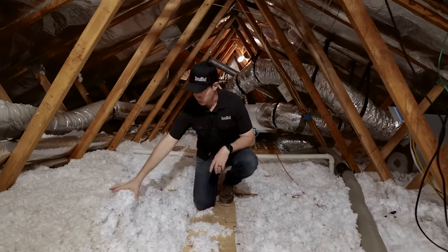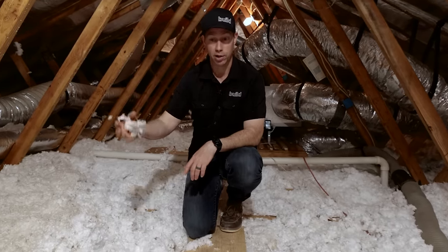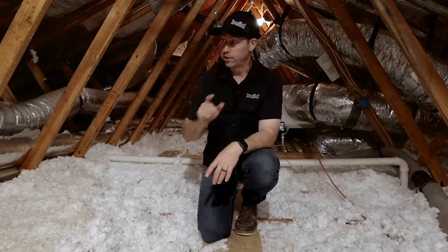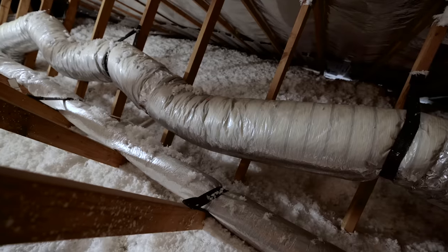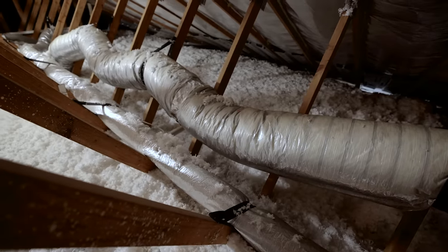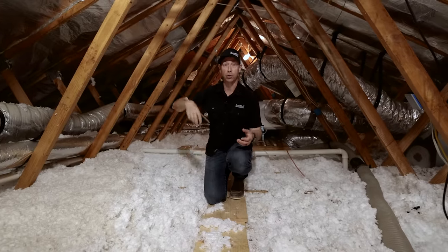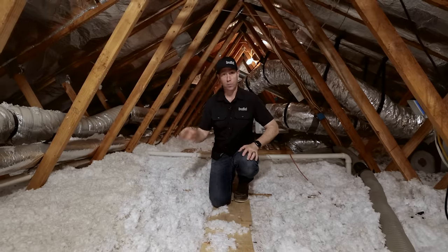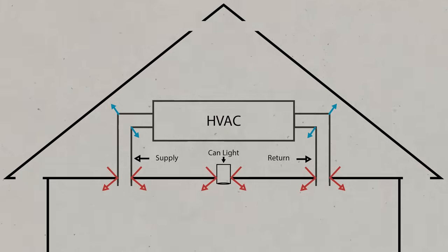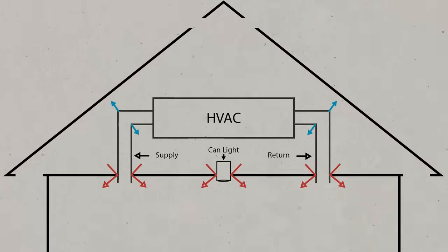Here's why: we've got a bunch of can lights, bath vents, cuts in the drywall, and probably wires through top plates that are not sealed — all letting air leak between the attic and the house below. A lot of the dust you find in your house is actually small particles of insulation getting sucked back in. When HVAC vents leak, it depressurizes the house, and the house makes up that air by pulling it in through cutouts in the drywall, bringing all the nastiness from above.